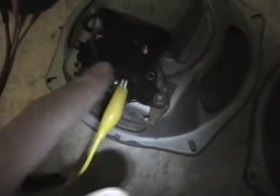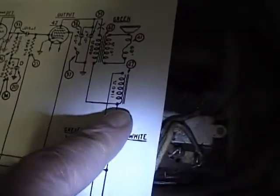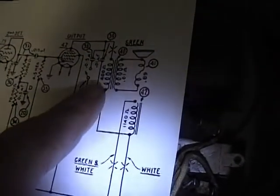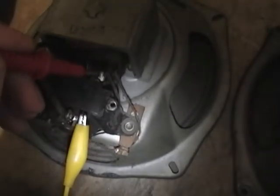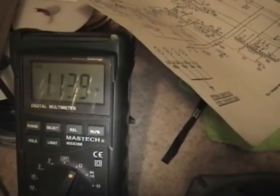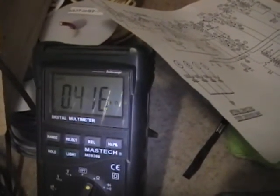Here is the common connector for both the field coil and the transformer primary. I should read about 1140 for the field coil and around 400 for the output transformer primary. The field coil reads 1139 — that's pretty darn good. And for the output transformer, I got 416, and I'm always looking for 400, so I think we have got a winner.